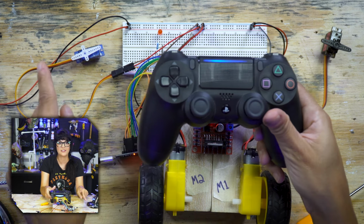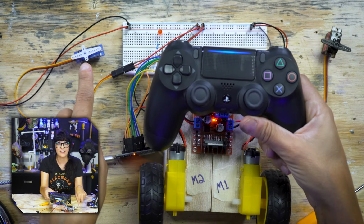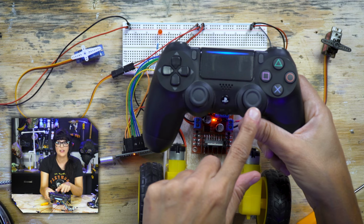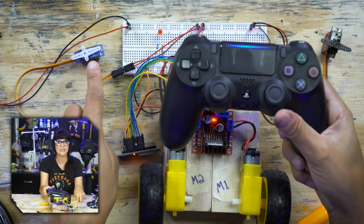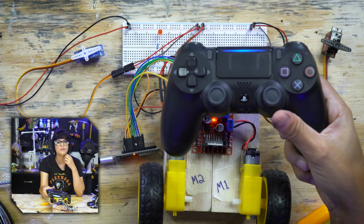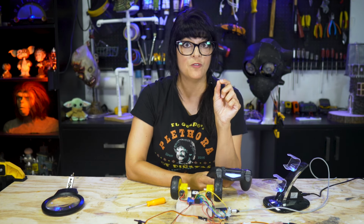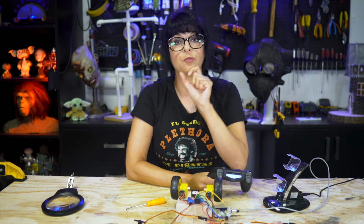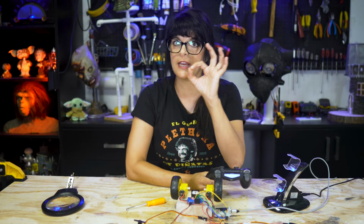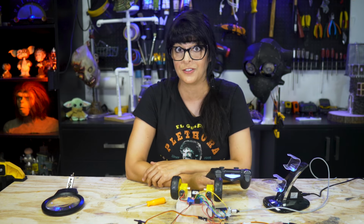And if you're not precise, you'll activate that one. And you may be asking, why is that one jittering? The reason is because your idle fluctuates. Now, depending on the servo, sometimes it doesn't affect it too much. Other servos get very jittery. So how do you fix this? Exactly how we fix the motor. In this case, you would have to come up with separate movements for left and for right, and then for up and down, and create a dead zone where you hard code that dead zone to 90 degrees. And that should lock that servo into 90 degrees.